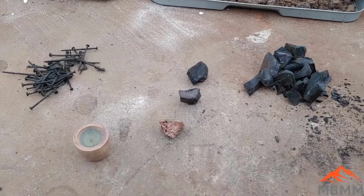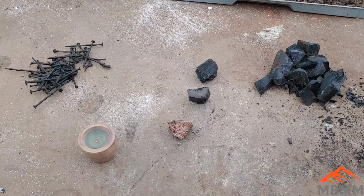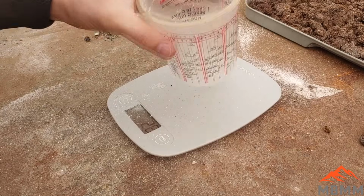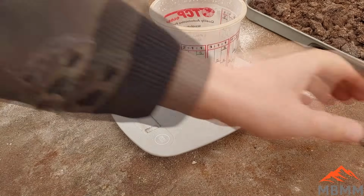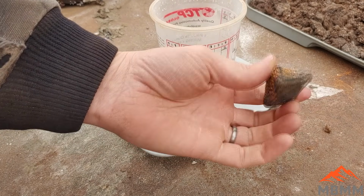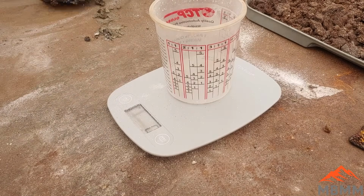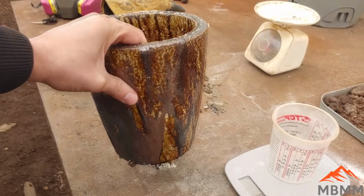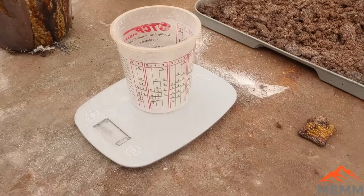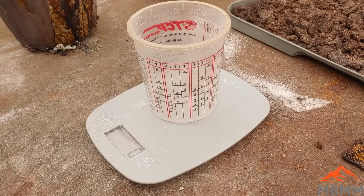I'm a lot more interested in adding a little bit of sulfur, getting a huge block of metal, and then electrowinning it away. What I want to do now is I really like what we did here with a little bit of sulfur in the iron, and we got a nice metallic block. So now I'm going to increase the volume, and we're going to use a number 12 crucible here. And instead of doing 200 grams, I'm going to do 2,000 grams, with the same proportions of flux and sulfur. So let me get a batch mixed up here, and then I'll tell you what I did.